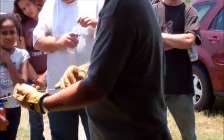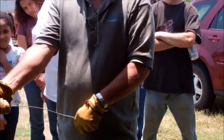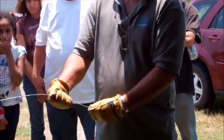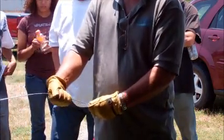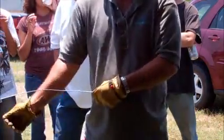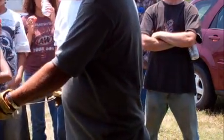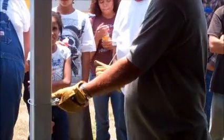Take it, let it turn in your hand. I want my insulator about that far from my post. A lot of people put them way out here — why would I not want to put them way out here? How many of you have got sheep and goat? If you've got a foot of space right there, they're going to shoot through it. So I'm always going to put my handle just about a hand's width from the post. Not many sheep or goats are going to slide through that, but they'll try.